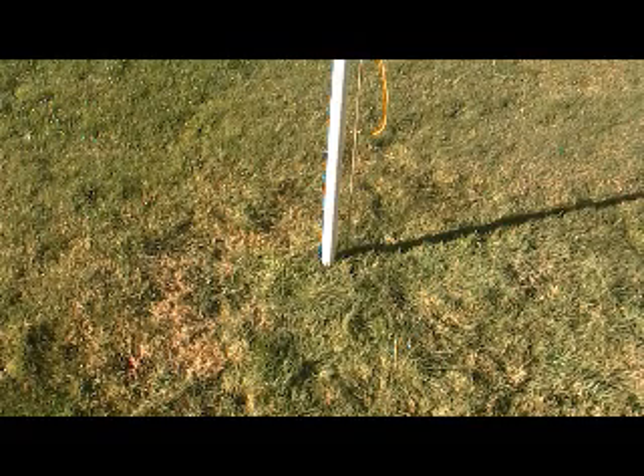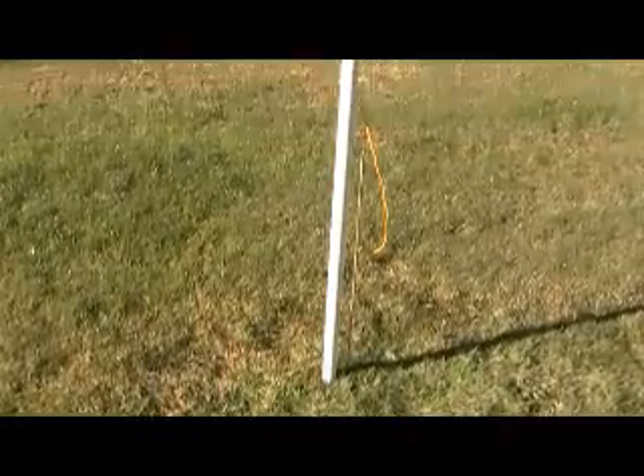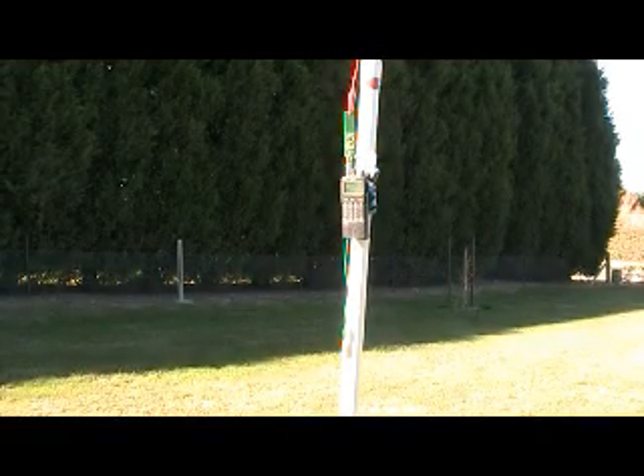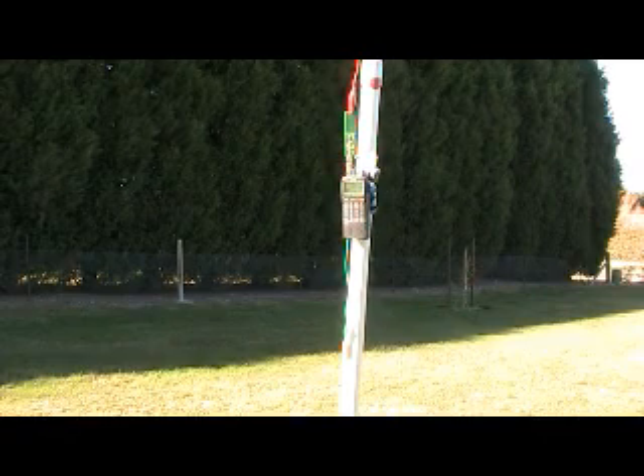The test setup includes a ground stake driven about 400 millimetres into very wet clay. You'll see that to the right of the white pole. The white pole is a plastic pole slipped over a wooden stake, so it's not conducting. Mounted at 1.6 metres up the plastic pole is an ICR20 battery powered receiver, and the mini-whip amplifier is also battery powered.